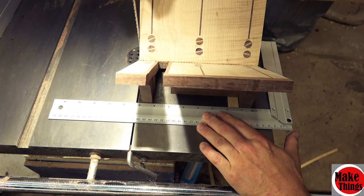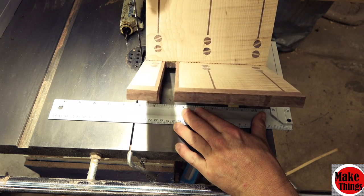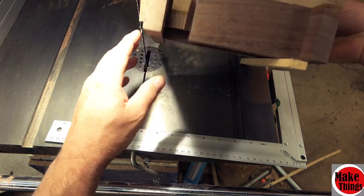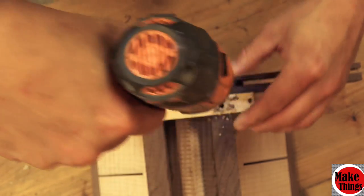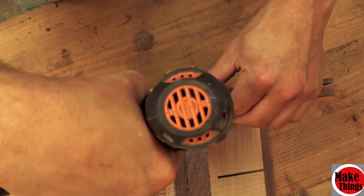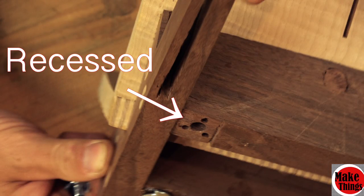To get the nice 90-degree cuts I was after, I used a piece of pine that fit my miter slot and used hot glue to temporarily set it in place. I drilled a couple quarter-inch holes for the bolts that would pass through the pine, as well as a pilot hole for the jig itself to attach T-nuts. After tapping and drilling the spines of the T-nut, I carved out a recess so the T-nuts would sit flush with the bottom of the jig, adding epoxy to finish it off.